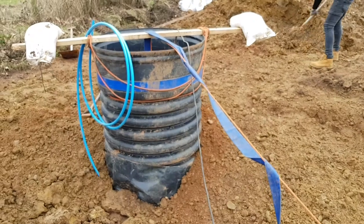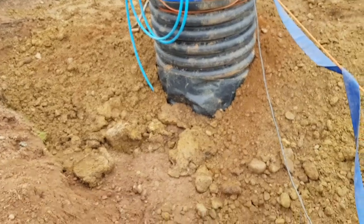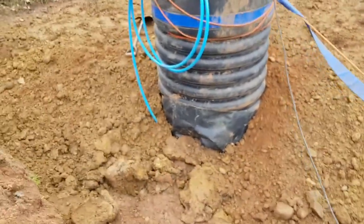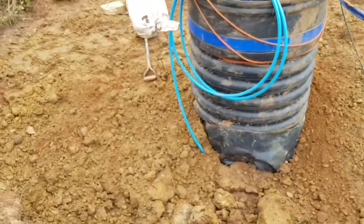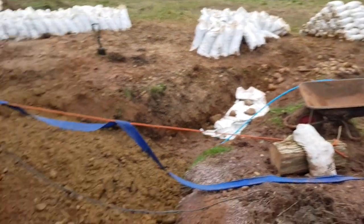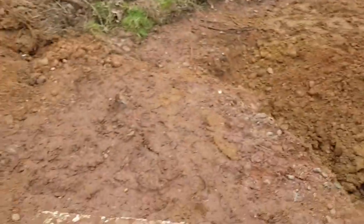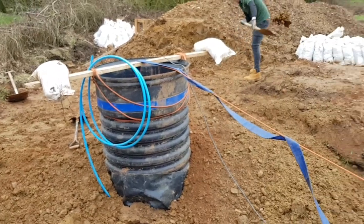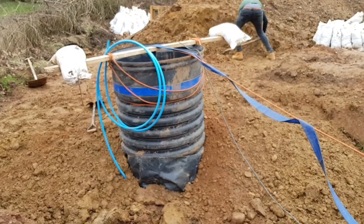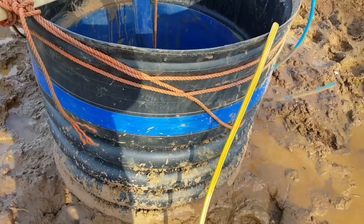We're on to the next stage — pretty much full to the top and we've started putting in the water pipe. This is going to be connected to a big tank and a little 24-volt pressurized pump which will give us a 50 psi supply from here, wherever we want to take it across the rest of the farm — basically the equivalent of a mains water supply. The five-thousand-liter tank is going to sit over to the left, and we'll put everything in a little earthbag building. Let's carry on filling this in.